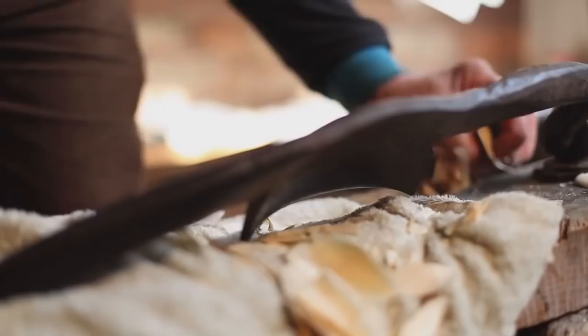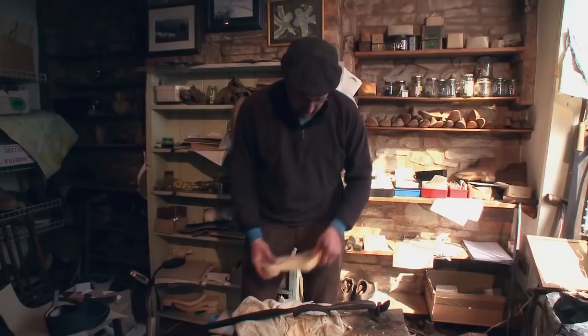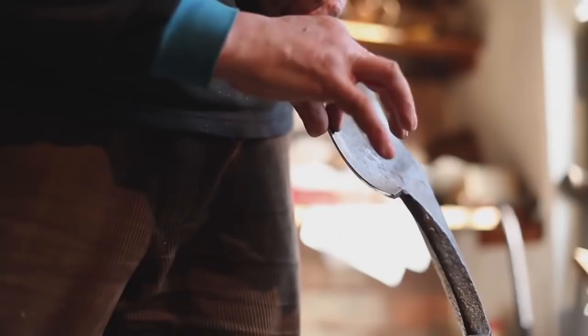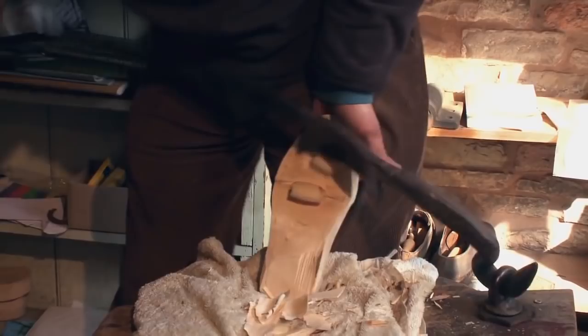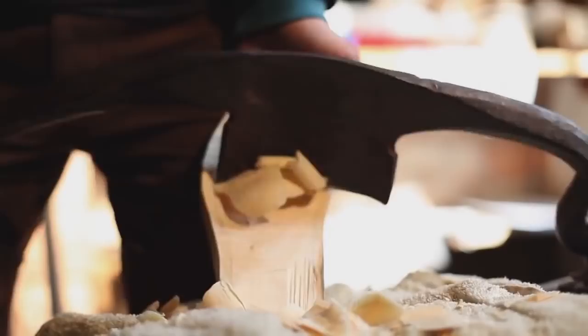This is the Hollower. In Wales, sometimes they're made in two pieces. On the stock knife which you saw me use, it's very fine — you want it as fine as you can get it. You want quite a steep edge on the back, maybe 30 degrees, 25 to 30. The other one's more like 15. If you don't have that, it doesn't sit on the back bevel, so when you go down here it rocks and you get a series of ripples. That's cutting a nice straight line — I'm not getting any ripples, it's just going straight down.